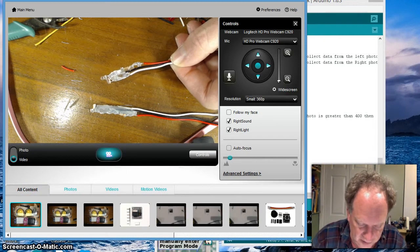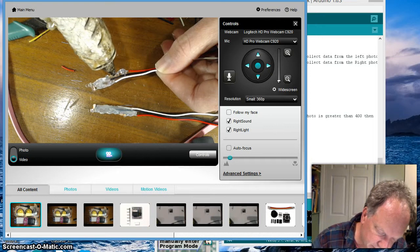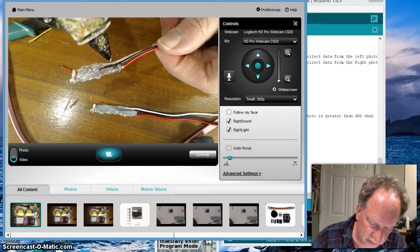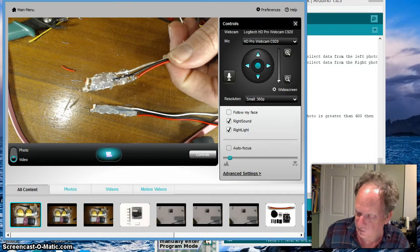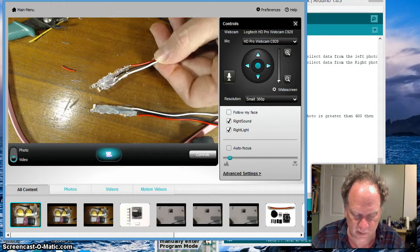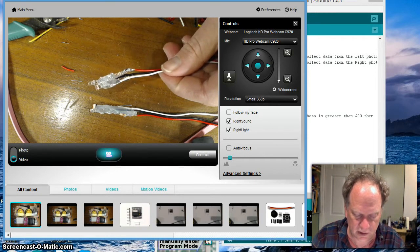Okay, it's been another 3 minutes, and you can see it's already turning opaque, so it's nearly dry. This will be the last time. I'm going to fill in this void here. Cover this wire here. Because again, if I'm in battle, I don't want anything shorting out on my circuits, right? You don't want somebody's steel feeler to bump into your robot and cause it to short out. That would be bad. So you want to make sure everything's nice and covered. And slowly rotating it a little bit back and forth while it dries keeps the blobs from dripping. It only takes a few seconds, and then it just stops. Okay, it won't start dripping anymore.